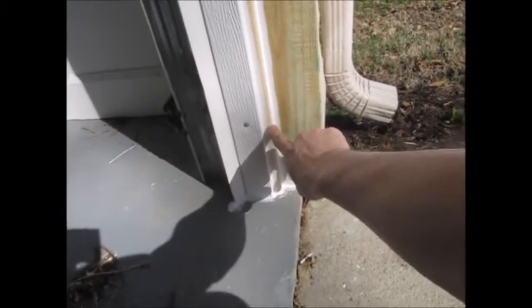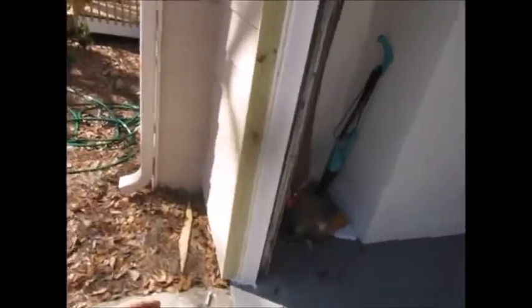All finished — got the weather stripping up all along the sides and the new weather stripping on the bottom of the door, so it makes a good seal. Caulking is all in there too. If you're doing this yourself, make sure to check for any rotting wood at the bottom. I had a board here that was rotting and the two boards on top of it were rotting as well, so I replaced those and used an additional small piece — same on the other side.